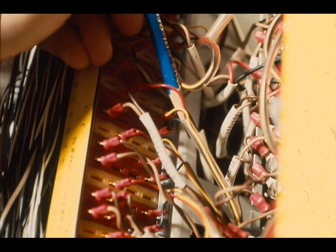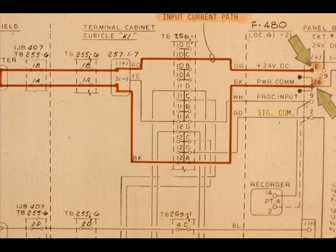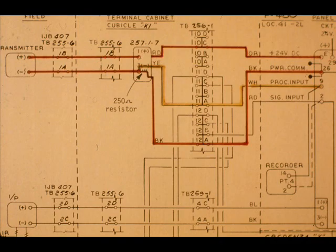Here are the black, red, and yellow wires coming out of Input Module 257-17. This is the current path we traced — it is the transmitter or input current path. All the current went from plus 24V to power common. No current went through the yellow wire. The yellow wire is the 1 to 5-volt signal. The devices that receive the signal, such as the controller and computer, have very high input resistance. Therefore, practically no current flows to them.